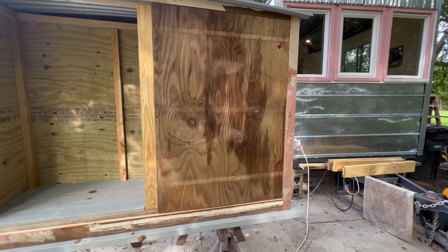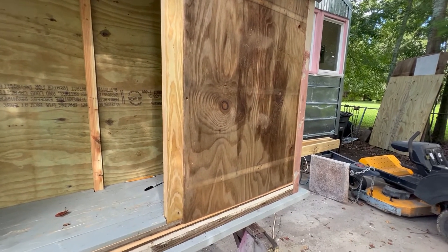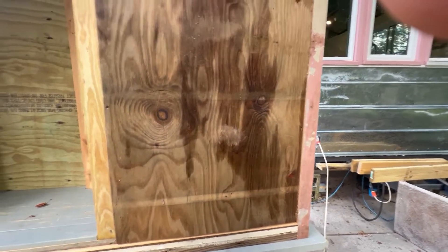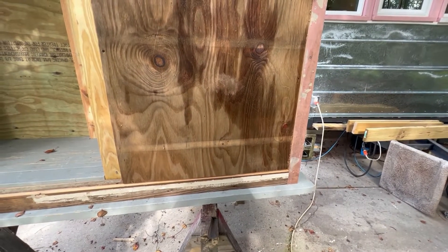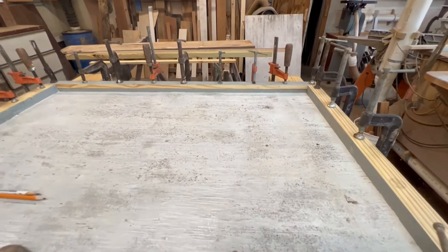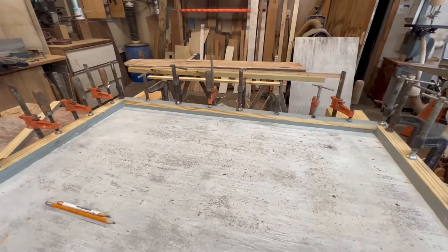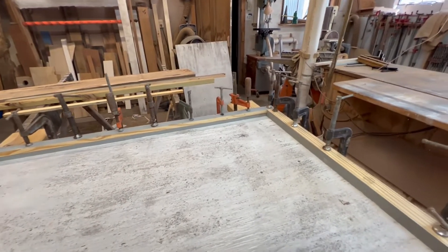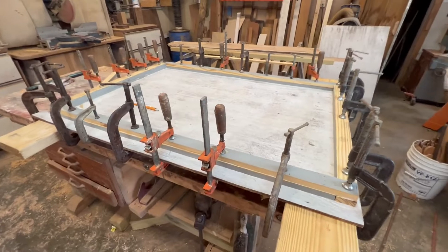Okay, changed my plan. I got the three-eighths plywood and screwed it in place with a couple of screws, good side facing in, with the inside perimeter marked with a Sharpie so I can put a frame on this side in the right spot. After that I'm going to put siding on the outside of this plywood. I got the first door with the braces on the back clamped up - I used two strips laminated together for two reasons: one, this is southern yellow pine and it's real twisty, so using one piece risks it taking a bow; and two, I had a bunch of little pieces I could get these rips out of.